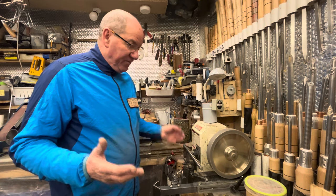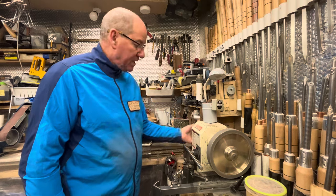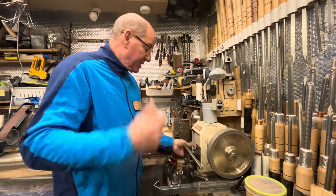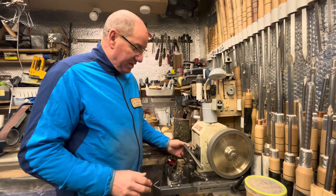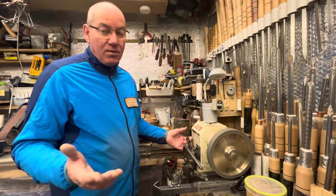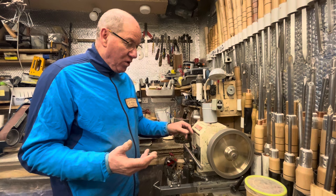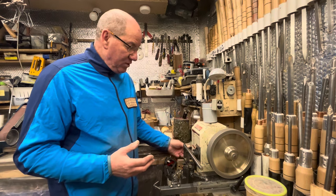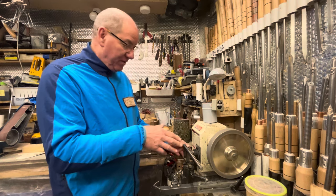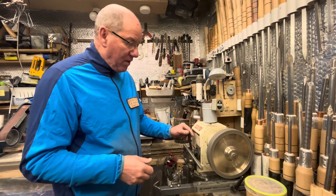And the first thing is, if I'm sharpening, oh no, not quite right, I want to stop it, okay? I go like that, I've got the hand wheel here, they're stopped. I can make my adjustment, start up again. It's immediate, it's there. Speed, I can go up. I never sharpen up on number four. I normally sharpen, the fastest I go is there, and normally it's always down here, which is 500. But sometimes if I've got to grind something down, then I'll go up a bit higher.